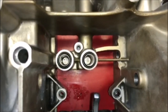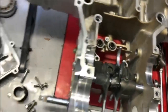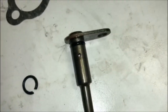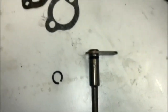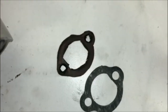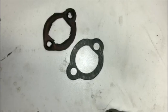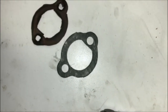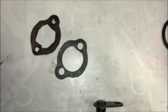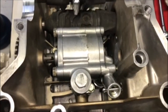If you're doing one of these engines, you really have to order separately these two O-rings and the O-ring that goes on the oil nozzle, which I now have installed. There's no comparison between the gasket I made and the correct one. You really have to make sure you order these O-rings separately from the gasket set. I've now got the oil pump reinstalled with the correct O-rings and the correct gasket.